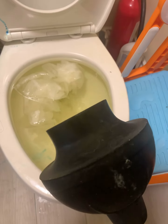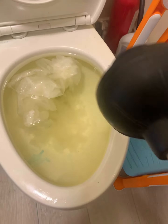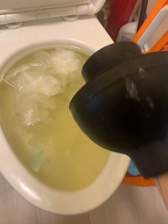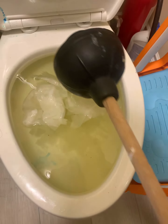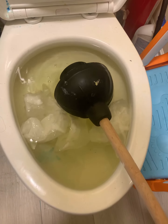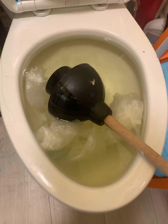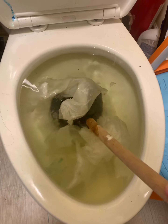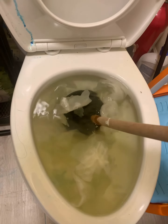Today we're going to use a simple basic plunger to deal with this issue, and how to do it properly. Plungers are almost the same, but the technique can be different. What you want to do is fill it up with water — like this — because water is not compressible, it almost cannot be compressed. Air can be compressed, so you don't want air in the plunger.